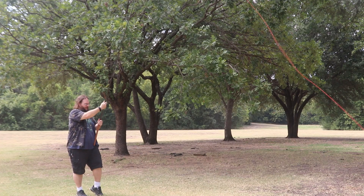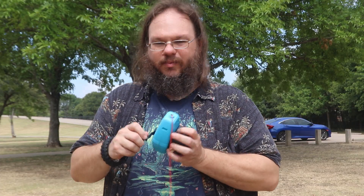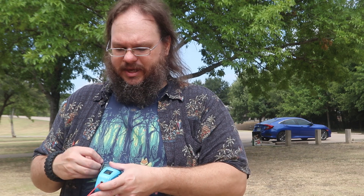That was a lot of fun. When the contacts started coming in, I got a good old pileup going on this Reel POTA antenna — it was working great and beautiful. The lines behind the radio are not hot, so they transmitted well, no issues there. Let me pack it up and give you my final thoughts. Cleaning this up and winding it is a breeze — just wind it up, no winders needed, just keep cranking. I do like this antenna. It was easy to set up. I did have to tune it, but if this were my permanent antenna I would mark it on the bands where I need to run it out to get the good 1-to-1 at max frequencies, and then I wouldn't have to fiddle with it that much anymore.